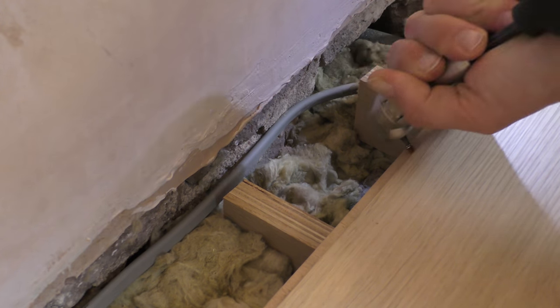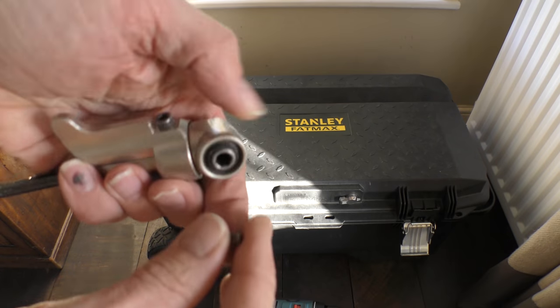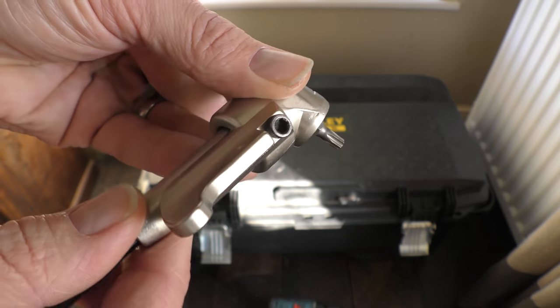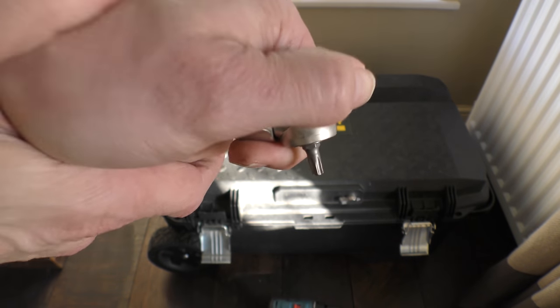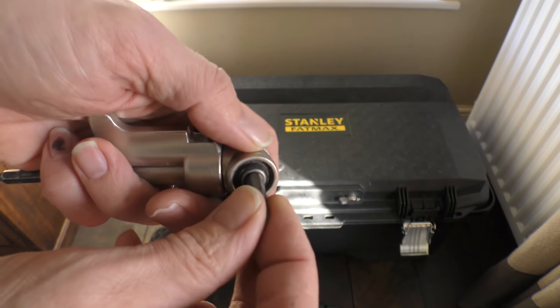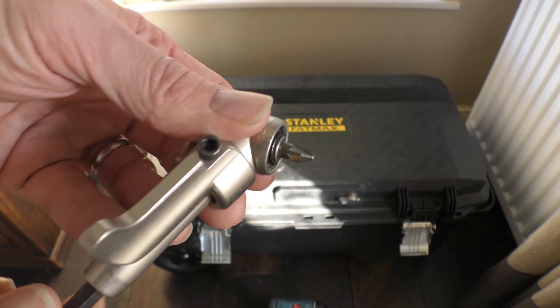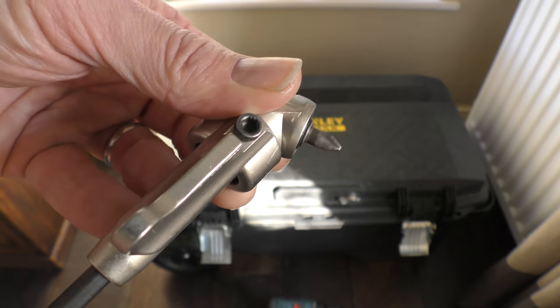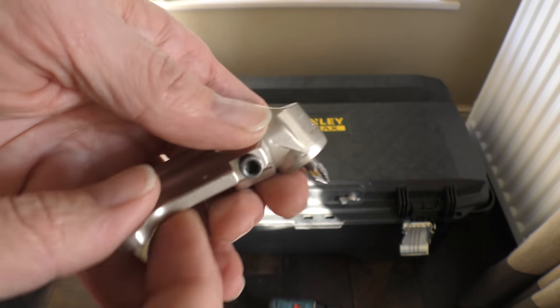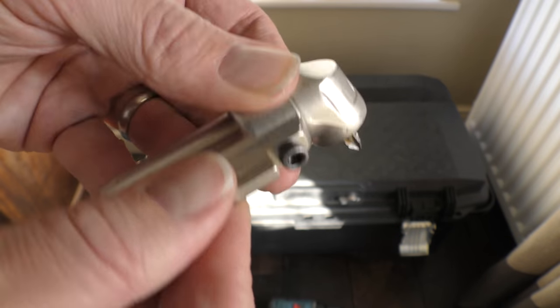Which is really useful because when you are trying to maneuver this in tight spaces, you have to get a bit of purchase on it with the hand that's not holding the drill, in order to keep that screwdriver bit solidly positioned on top of the screw. Now you could make your life a lot easier by using torx bits, which don't require nearly as much positioning and force when driving a screw home. But given that particularly in the UK we have this fixation still with PZ bits, for the time being these are here to stay and those are the ones you're most likely to be using, so the stabilization arm is very important.